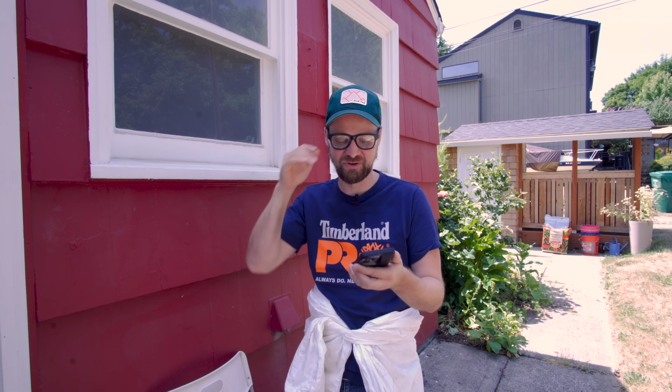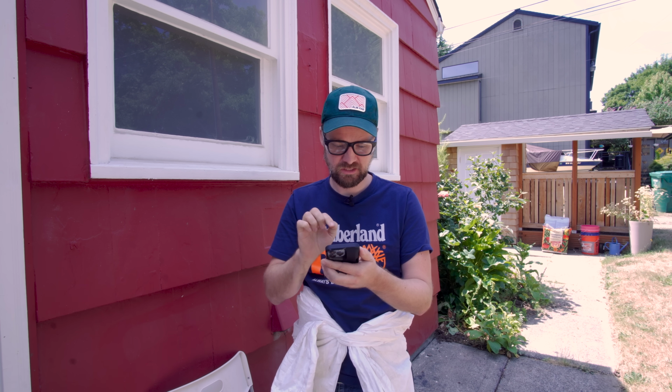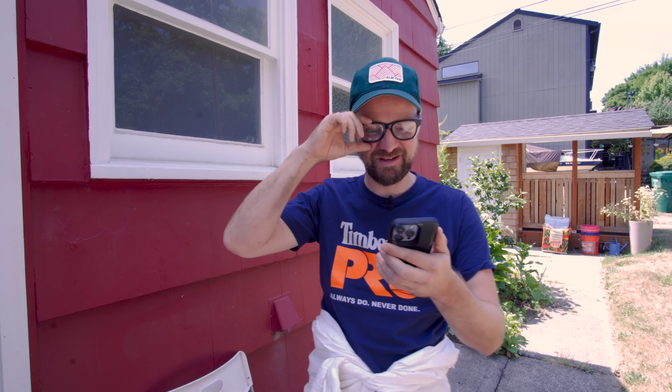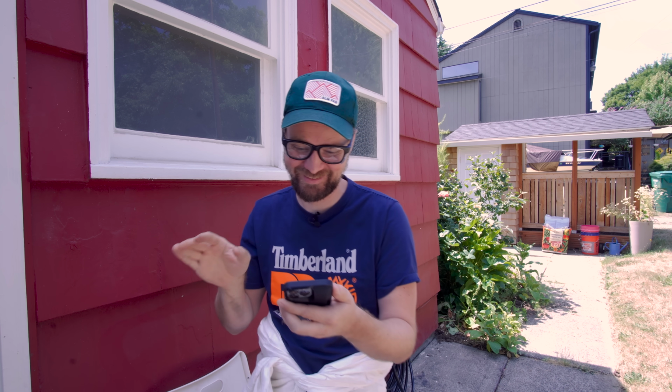All right, I just got an alert on my phone. The lab results are back. So let me go to that. Bulk asbestos fiber, I'm nervous. Okay, bulk asbestos fiber analysis. Layer 1 of 1, description: gold flaky, miscellaneous material. Non-fibrous material: binder, filler, fine particle mica, vermiculite. Okay. Other fibrous materials: 9% cellulose. Asbestos type, percentage: actinolite, less than 1%. I legit don't know if that's good or bad.